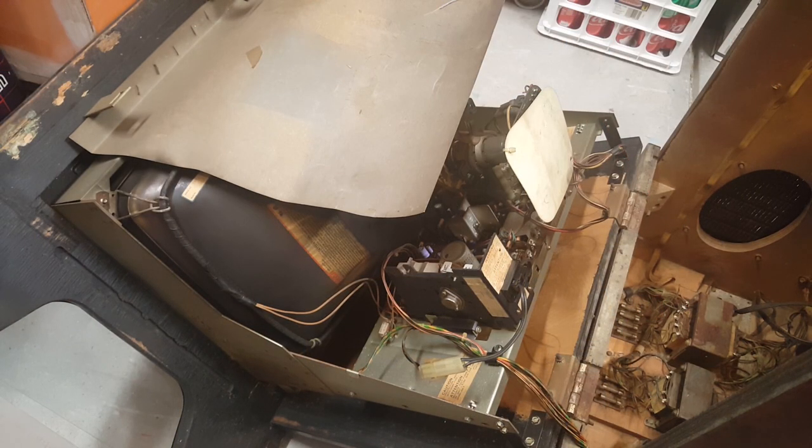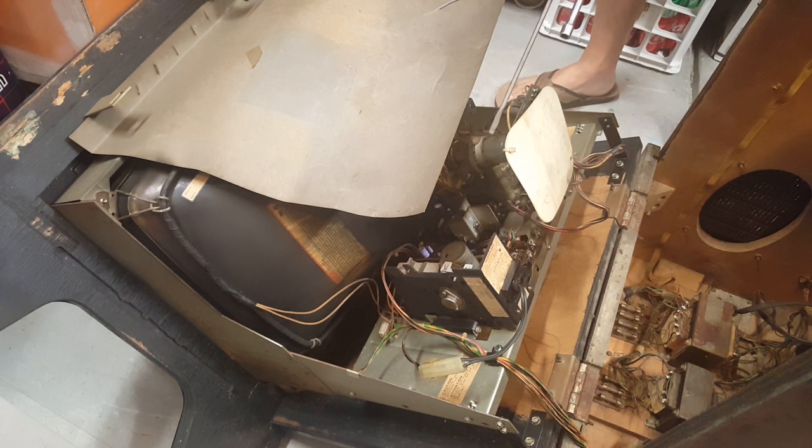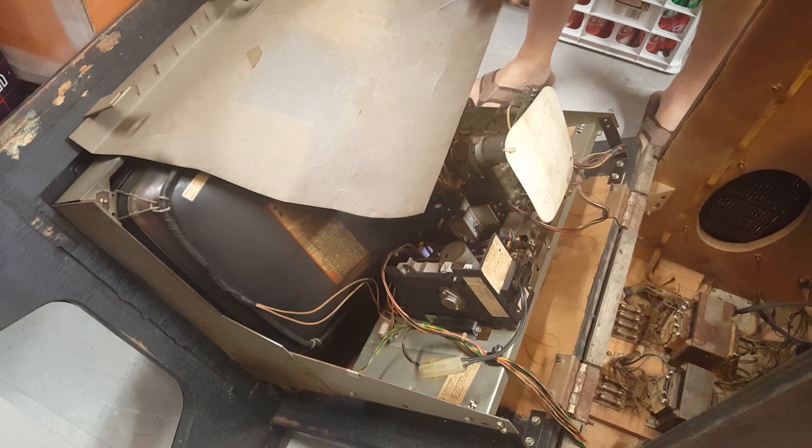All right, so for educational purposes, I'm going to go over a few things. First thing you want to do, obviously, when you're working with your monitor, is unplug the cabinet. Got the cabinet unplugged, so now I'm sure there's no voltage running through. But basically, the way a monitor works is it's kind of like a big giant capacitor. So the tube can actually store voltage, and that's why you need to discharge a monitor. This one probably isn't doing anything because it's completely dead. When we booted it up, there was no neck glow here in the neck. So we're just going to go ahead and try to discharge it anyway.